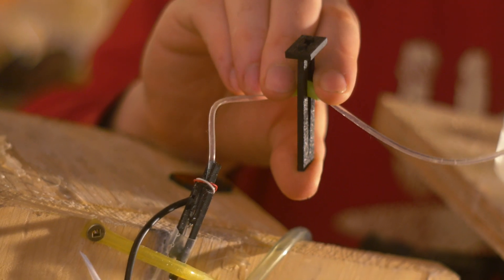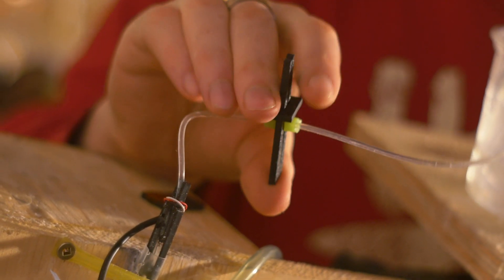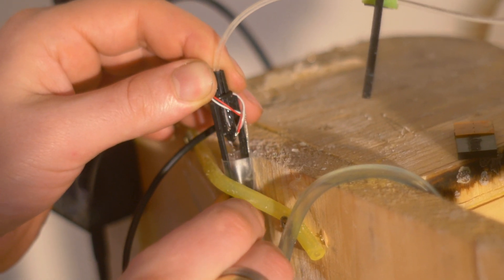Another improvement is the valve and how you control the speed of the printer. In the last revision we controlled the drip rate by changing a valve, but it was a little finicky. We found it's actually easier to change the speed by using the height of the siphon as the change in pressure. This eliminated the need for a flow-control valve, which also means there's no small spot for particles to clog. Instead, we have valves just for turning the printer on and off, cut with the laser cutter. The new dripper slides up and down to control the pressure going to the dripper.